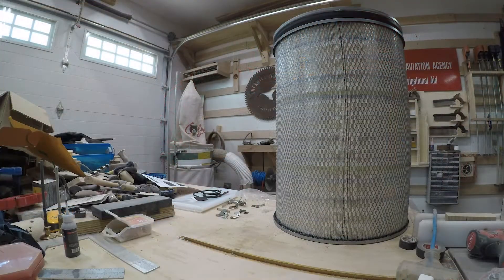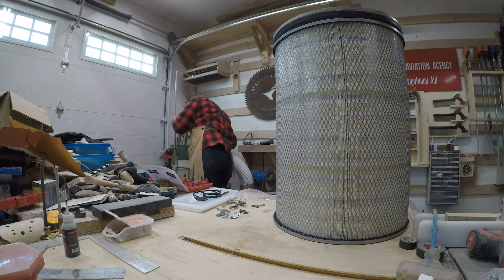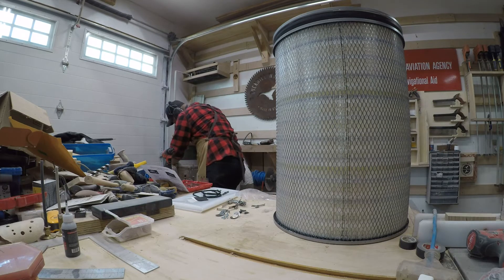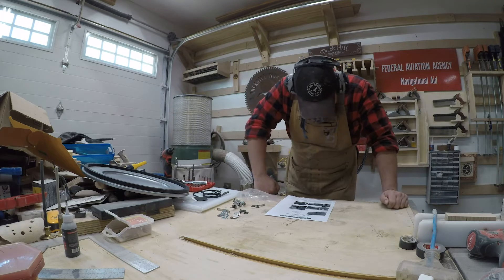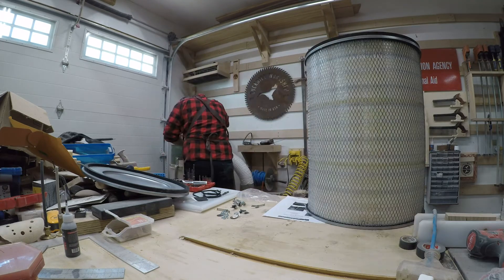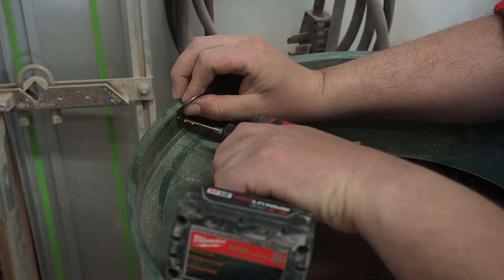Alright, your first steps are to take off the top filter bag and its little hanger, and clean the pan out. Mine had a bunch of dust and crap on it. The filter is going to sit on that pan inside, so it needs to be clean and free of debris. Now you're going to lay out where your mounting tabs are going to go. You've got to drill holes for those and screw them in with a little spring plate.